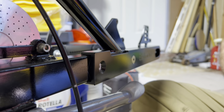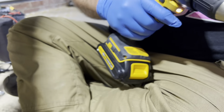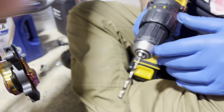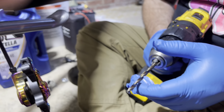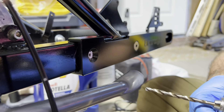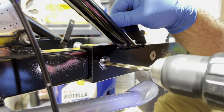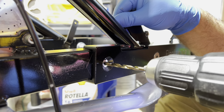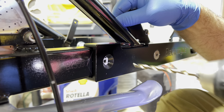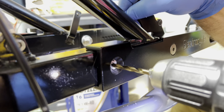From there I'm going to go to a 13/64. It doesn't matter what size you go to, but I like to progressively get bigger — it makes it easier to drill rather than sticking a big bit in there right away. I'm going to put it straight on that hole and drill. You can already see I've punched through — it goes quick now. Make sure you're still hitting that other hole and drill through the back side.